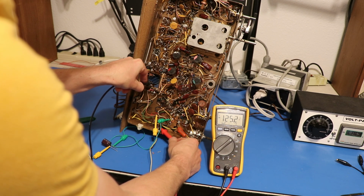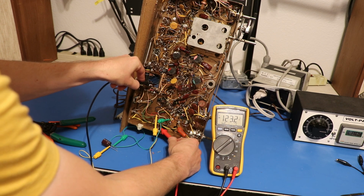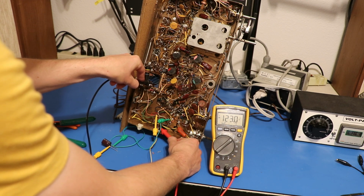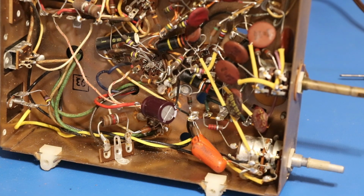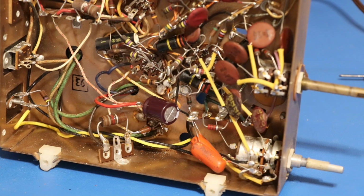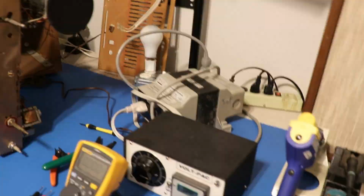I'm thinking we're going to get an actual working radio now, because we have an actual capacitor helping out our good old selenium rectifier. Now the selenium rectifier probably still needs to be replaced, but for now we're just going to see if we get actual sound. You gotta basically put this whole thing back together to test it, so that's just in there now. That's gonna be enough for now. It can be corrected and done properly later, even though honestly it's not that bad. It's actually pretty okay.